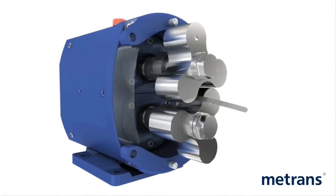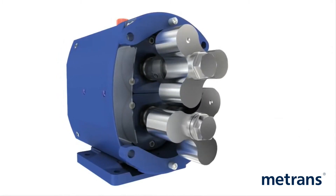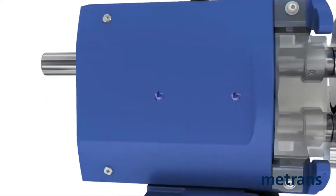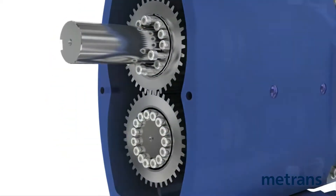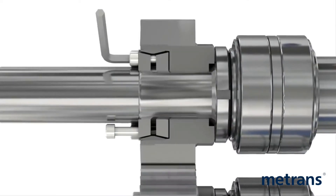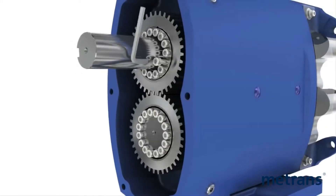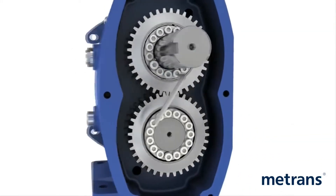This system allows quick and easy synchronization of the rotors, highly simplifying the timing procedure and reducing maintenance cost. By simply tightening a few screws, the gear and shaft are securely locked together. Also, with the elimination of keyways, users can benefit from increased pump life.